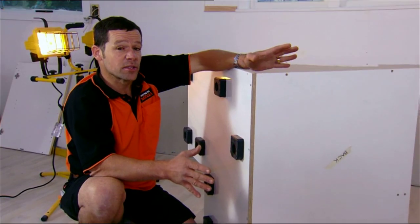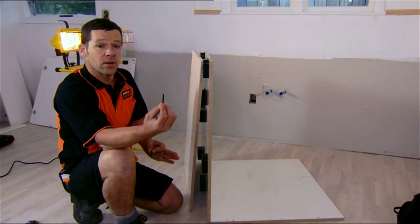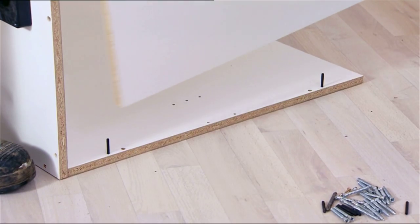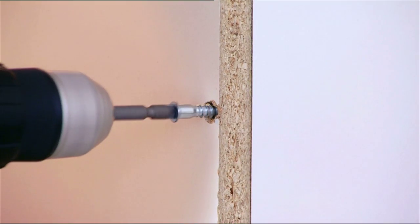There are a lot of pieces to this pack, so if it makes it easier for yourself, just get some masking tape and a marker pen and label every piece. Now, this here is our dowel — these help us align our panels together. Once your dowels are in, put in your other panel, just gently lower that over the top of our dowels, and using our big cabinet screws, screw the two panels together.